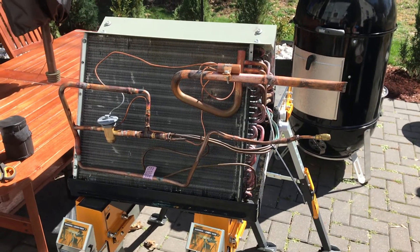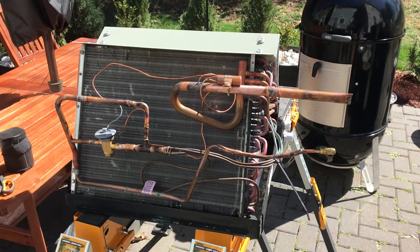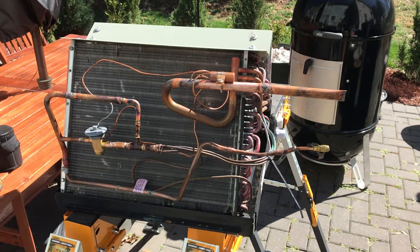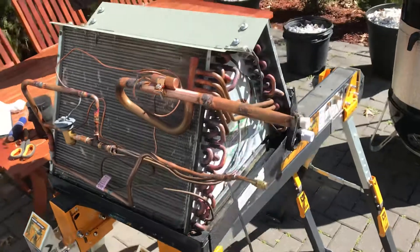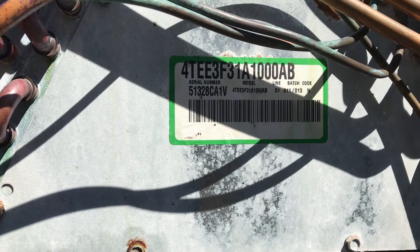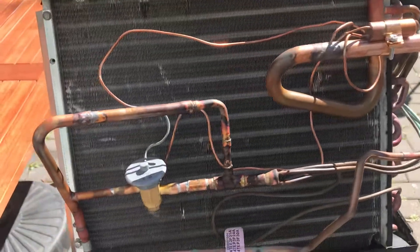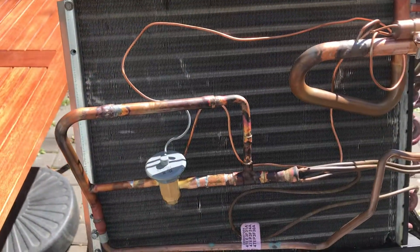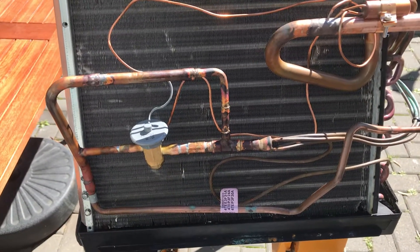This is just a really quick video. I wanted to show the difference between some brazing and soft solder products by Harris. What you're looking at here is a Trane A-coil — it's a two-and-a-half ton unit, model number 4TE3F31A1000AB, out of a heat pump. It has a TXV right here and also a check valve so when it runs in heat pump mode it doesn't mess up the whole system.